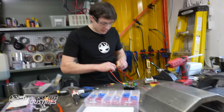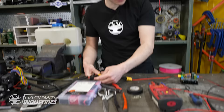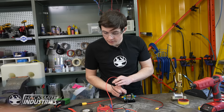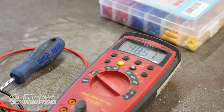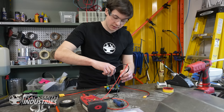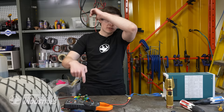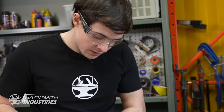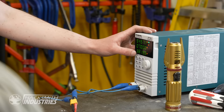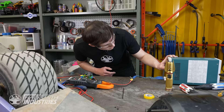We need to figure out the current setting as well. What's cool about this particular boost converter is you can set how much output power it gives, so we don't want to overcharge the batteries too quickly. I'm going to plug this end into our engine — we're at 48.8 volts input, which is exactly where we want to be. The output we want is 56 volts. By simply taking a little screwdriver and turning our trim knob, we can dial it up. This is acting like our Onewheel — it's actually pulling power from our converter, letting us monitor exactly how much power it's using. We want that top number to be 56, and this is now limiting our power, which is good.